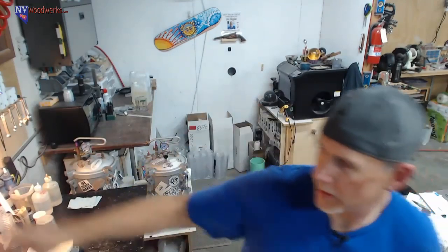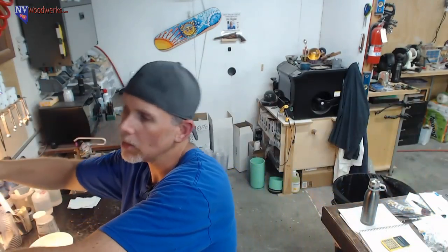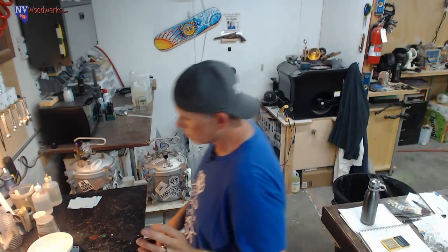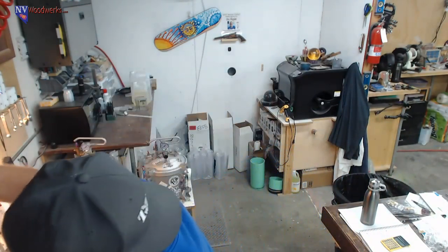Honeycomb fast setting. It doesn't matter what you use. The only thing is some honeycomb brands or manufacturers, they don't work. They don't adhere as well. That's why I did a bunch of testing and that's why I sell a product that works the best out of all the ones that I tried. So I'd say that's the only issue. You can use any resin though. I use Alumilite or epoxy typically. The one thing I wouldn't use is polyester resin because it shrinks more. So that's the one thing I wouldn't do.